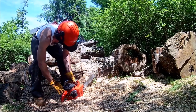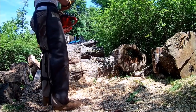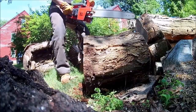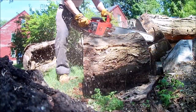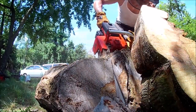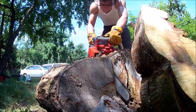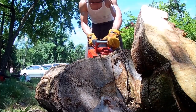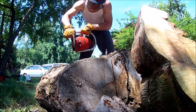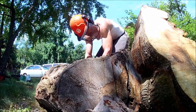Because these saws don't have an automatic oiler, you have to press that button — I'm pressing it with my hand right there. I'm making sure the saw's off to try to dispel some of the chips. This wood is very, very dirty and I didn't have a pressure washer or a hose, so I just started cutting. Count your nails because the trees are really old — signs and things that grew into the tree long ago. I kept hitting nails or bolts, and the dirt and rot would just keep binding. I'd shut it off and get that stuff out, then make sure the oil was getting through the bar. Sometimes when it's really hot, you put some oil, but it just flings right off and doesn't get into the bar where it needs to go, so I would manually make sure it got in there.